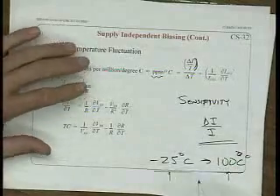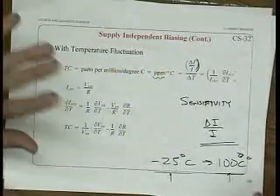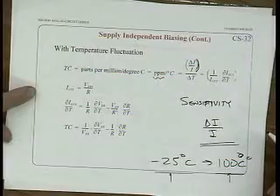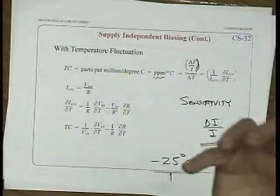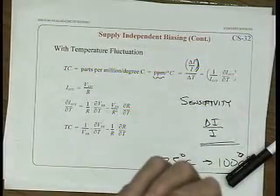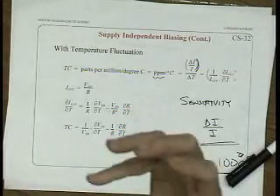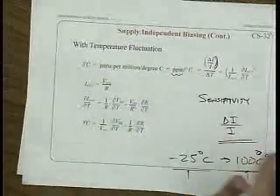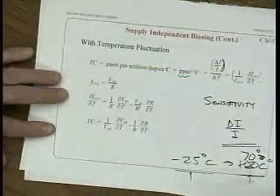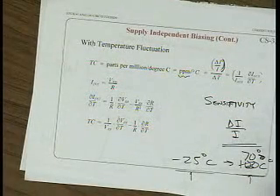Here's another type of supply-independent source using a diode-connected bipolar transistor and a resistor, with a multiple-emitter transistor. Multiple emitters in bipolar is like increasing W/L for MOS — the saturation current IS is proportional to the emitter area, just as for MOS in subthreshold IS is proportional to W/L. If you have a unit size emitter Q1 and make the other one N times bigger, then IS2 = N·IS1. VEB = V_thermal · ln(ID/IS). Going around the loop: I_out · R + VEB2 = VEB1. Solving, I_out = (V_thermal/R) · ln(N) — a ratio-based result.